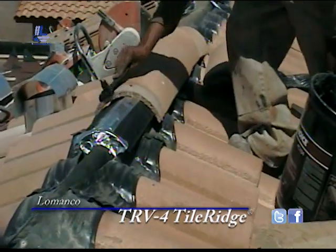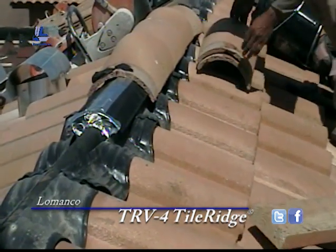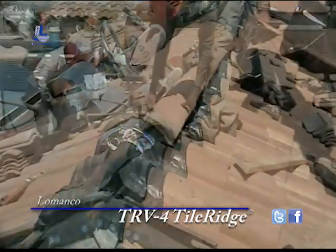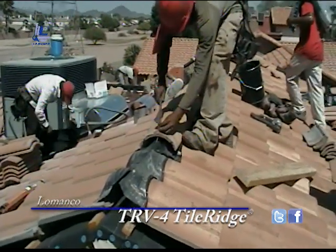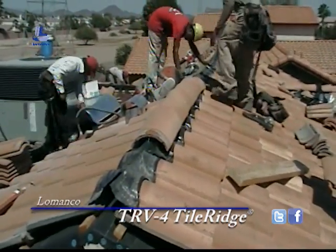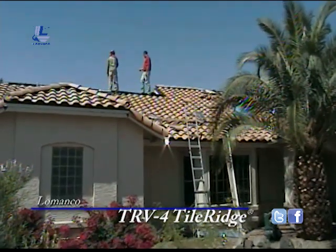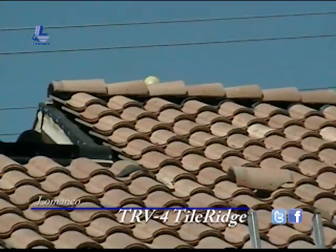The back end is resting on the field tile but the front is up as it broadens out, resting on the tile to the right. In this case they just ran a 2x4 for the ridge pole and then elevated it with two furring strips to give it increased height to use the TRV4. The rest of the ridge will just be a more traditional 2x4 application. Here's a last shot from the ground up where we're looking at that four-foot section where they did the sole light and the TRV4 installed, and you can see a really good straight line.